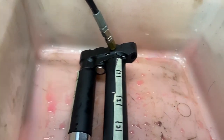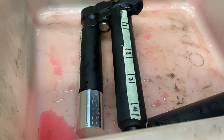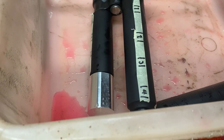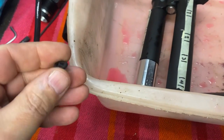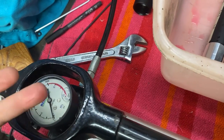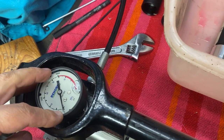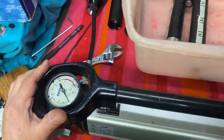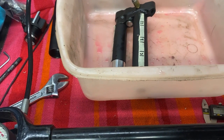And it survived, so we can come to that conclusion that there was an error in the first hydro test, and the pieces of the O-ring had gotten into the gauge. Then there were pieces in front of the gauge when I opened it. And yeah, well, live and learn. We make mistakes, so it goes.